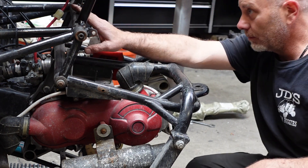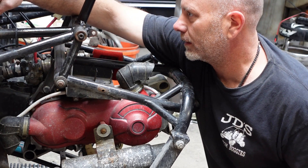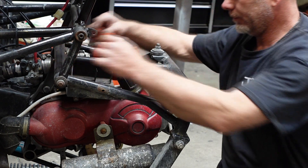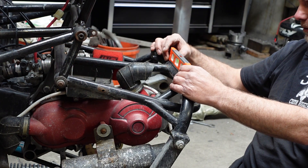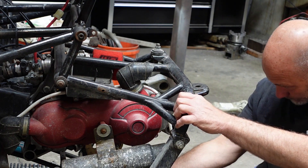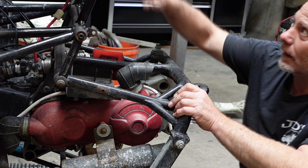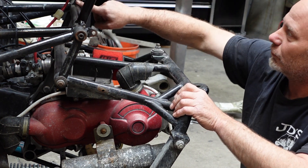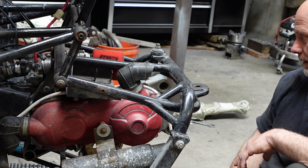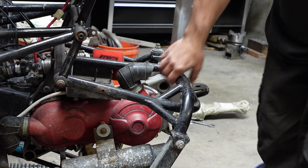What's funny is this bar from the factory is unbelievably crooked, so if I use that I'm going to be way off. This bar seemed to be pretty straight. That's fairly level. I'm gonna check my swing arm — the back of the swing arm is much more level than the front because of the way it's hanging. I'll check my axle — axle's level, and that's kind of the most important thing for me. Like I said, I knew when I put this gas tank mount on that the down tubes had to be two different lengths. I'm thinking I'm pretty safe to go with that right there. I'm gonna grab a set of blaster shocks.